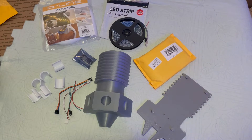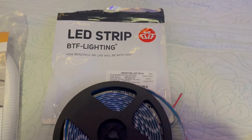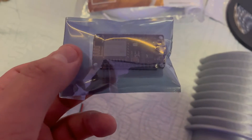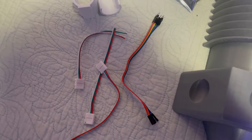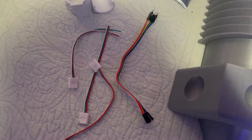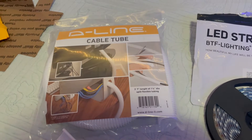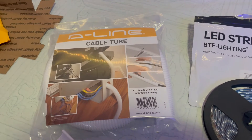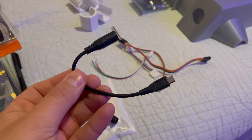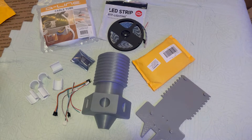For this project, you're going to need some 3D printed parts, which we'll talk about in detail in just a minute. Some addressable LED strips like these WS2812B strips, an ESP8266 microcontroller, these open-ended LED cable connector strips, some male to female jumper cables, a 5-volt power supply, as well as a split cable channel that you can find in any office store for our light diffuser. You'll also need a DC to micro USB connector and some electrical tape. I'll put everything in the description so you guys won't have to search for it.